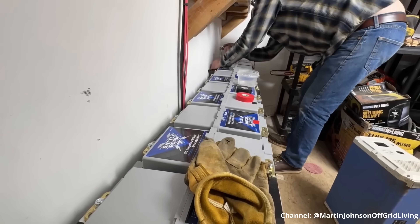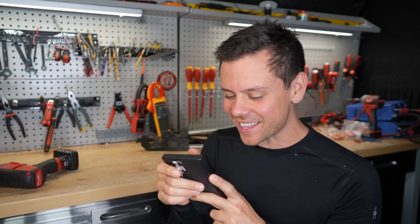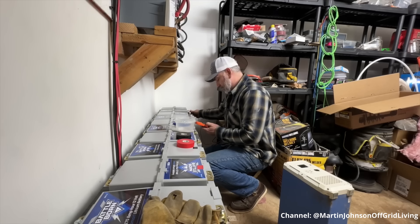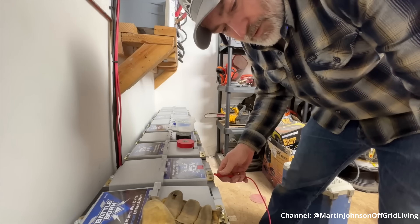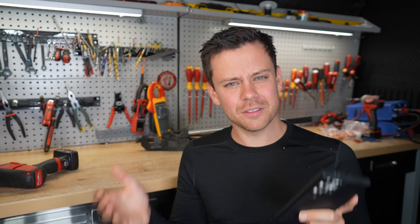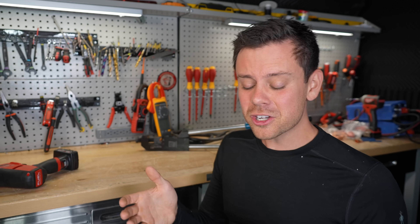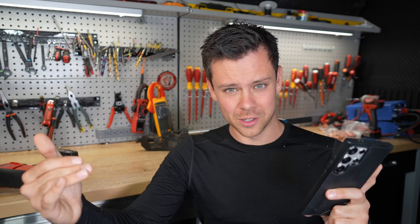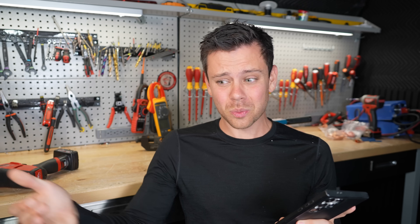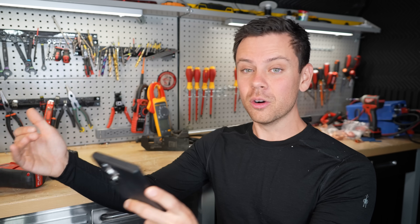He checks the voltage for fun and they're all reading 53.2 volts — he says it's perfect. But if you are going to do it this way, you need to charge up each pack individually to 100%. Do not use the voltage — it is not an accurate way to assess state of charge, especially when the batteries come from a factory. Charge them all up to 100% whether you series or parallel connect them. Hit overvoltage protection, let it disconnect, and then connect them all together.